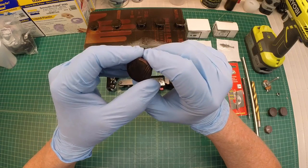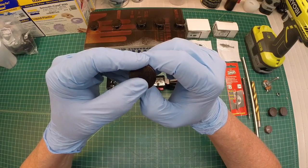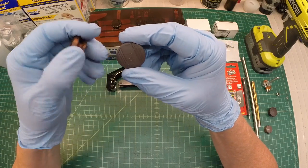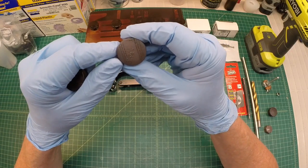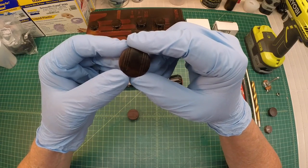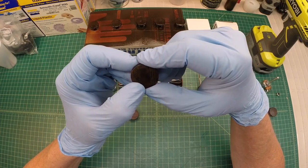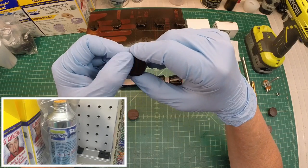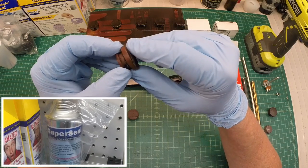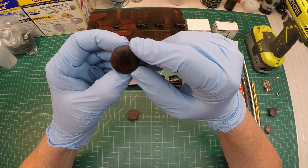The original mold that I created was pretty bumpy because this particular knob had a lot of buildup on it — lacquers and such. You can see when I created the mold and did the casting, all the raised areas and bumps are showing up, so not really high quality. I took time to drop the knob in some lacquer thinner and completely strip the old finish off of it. Then I had to use a sealing compound that Smooth-On has for wooden-type knobs or wooden articles that need to be molded, and I applied that material to the knob and created a new mold.